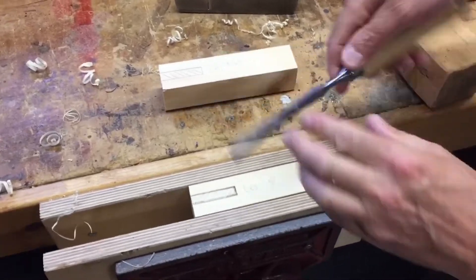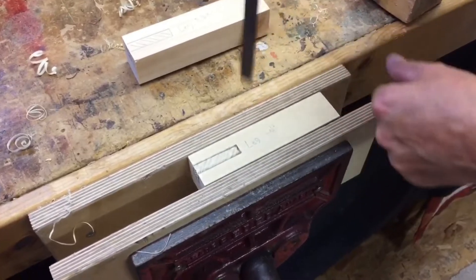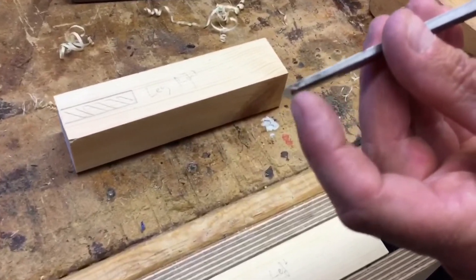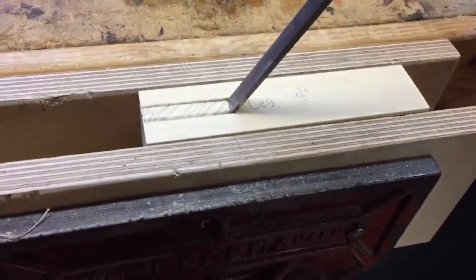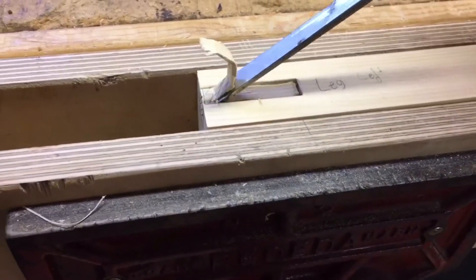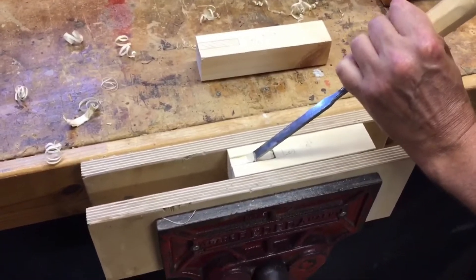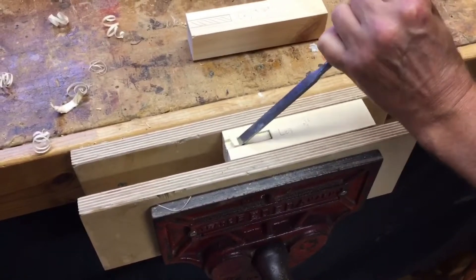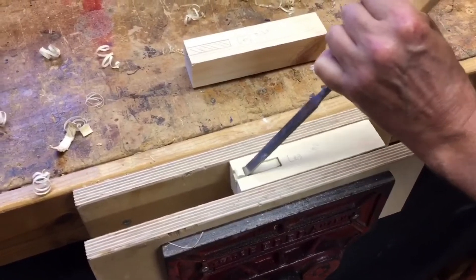Show the viewers — just tapping it. These are not heavy taps; if you tap too hard you're going to break your wood. Then you can either scoop the material out from this end, or I tend to do it from here — you've got to go vertically. I'm going to turn the chisel around so it's like a scooping action. The chisel must be very sharp; if it's not sharp get a friendly adult to sharpen it, or I have done a little video on sharpening. Take off little bits at a time.